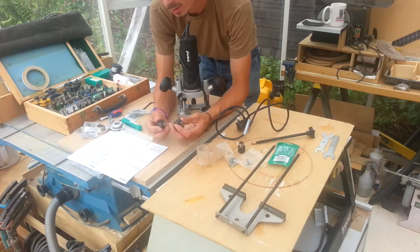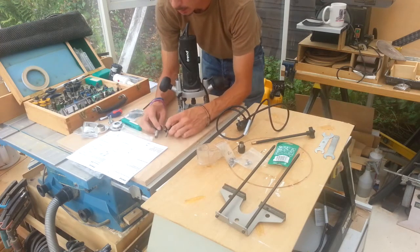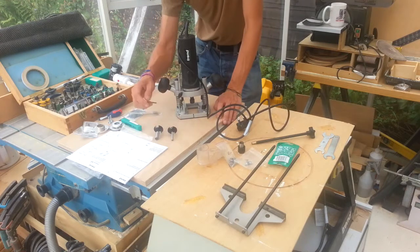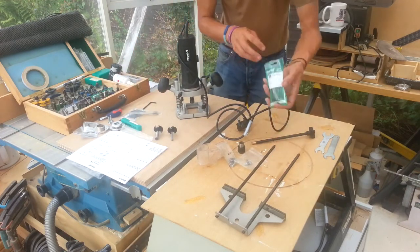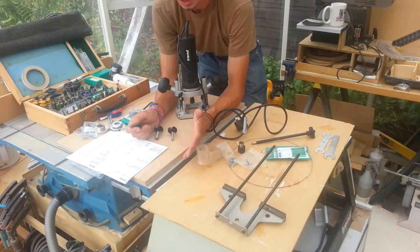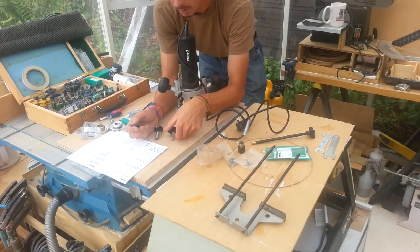So they are pretty much the standard. Certainly in Europe and possibly in the States as well now, there's a lot more metric cutters going in there. So one thing to consider if you go for the smaller cutters, which will be on a quarter inch, rather than big heavy duty cutters, which will get on a half inch, is an 8mm. Now, there's only between a quarter of an inch, which is 6.3 and a bit mil, and 8mm, that's only a little bit more in diameter.